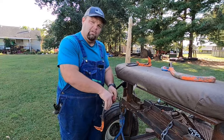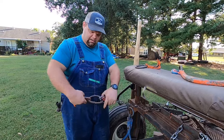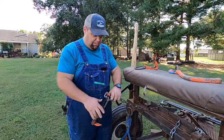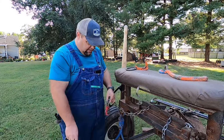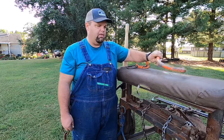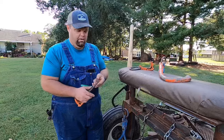Well, I was going to tell y'all it'd be easy, but maybe not. Anyway, y'all get the idea. So now you've got a chain right there. Hammer that thing in a log, roll on. If you've got a big log and you can't get under it for some reason and you can't get a swamp hook to it to roll it, because sometimes, y'all, a swamp hook is the only way you're going to move this big timber if you want to roll it over. That's the only way you're going to do it. That Peavey ain't going to get it. Not on the big stuff, not on heavy hardwood.